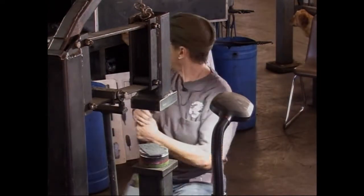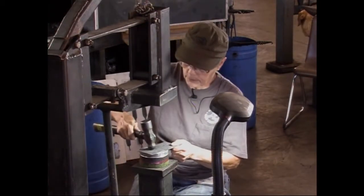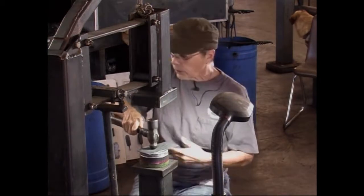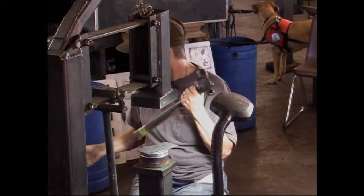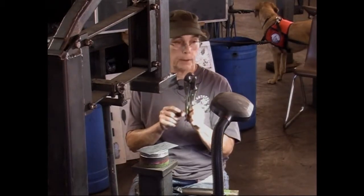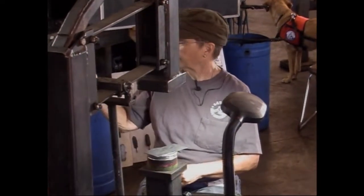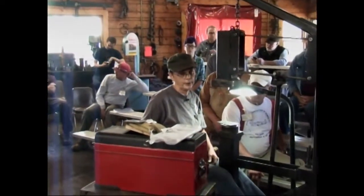Okay, I'm going to raise this part. I don't know what time it is. Quarter after, so we've got some time left. To raise this, I will use my ball peen hammer under here. If you're hitting something really hard or hot, I use my ball peen. If you're using your small tools, it's a 7LW vice grip, and you just put your tool right in there and it holds it, because if you're hitting tremendously hard, you don't want to put your hand under there.